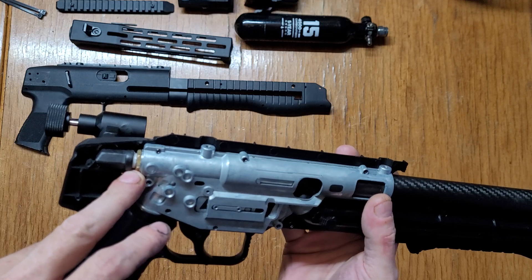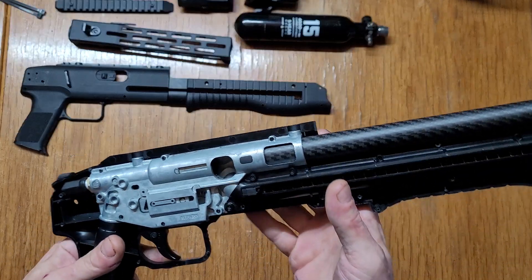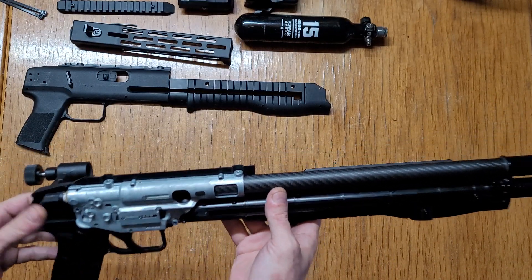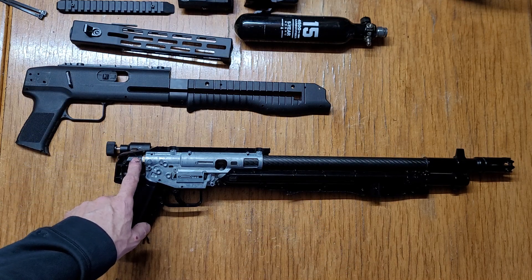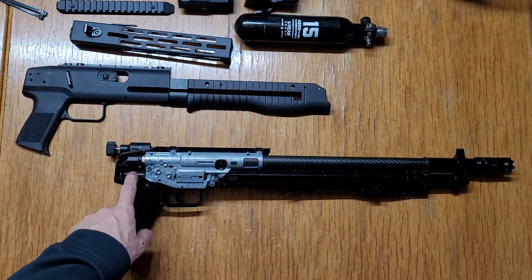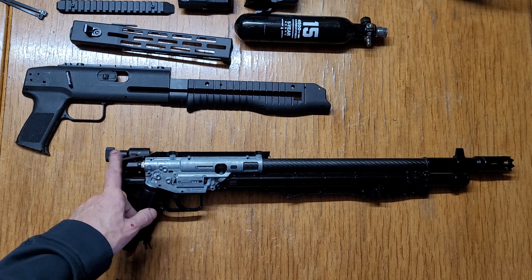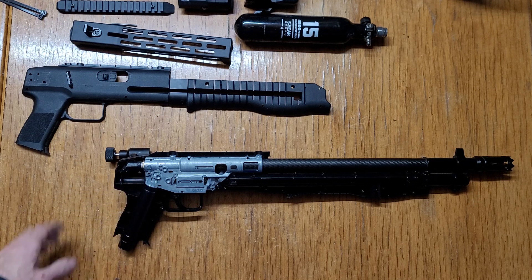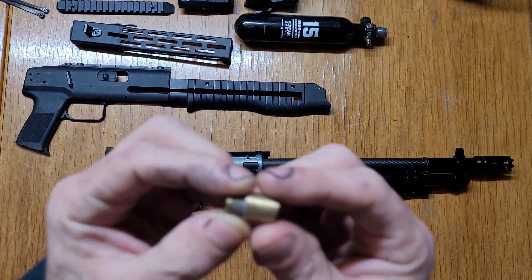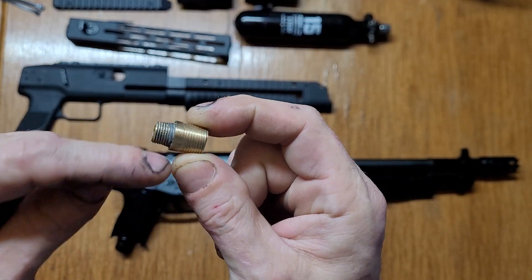Like the HDR 50, the HDR 68, and now the HDB. If you want to see how I did it, go look at my last four videos — they're all dedicated to these types of setups. Santa Claus from the groups told me a little trick on how to tap these. He does the 90-degree ones; I tapped straight-through ones. Anyways, to each their own — they're both doable. Here's the general idea: M13 thread and then a 1/8 NPT — I cut the hexagon off on this one.